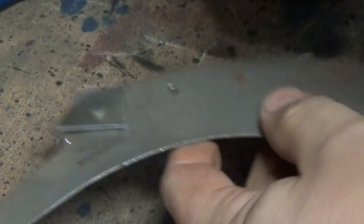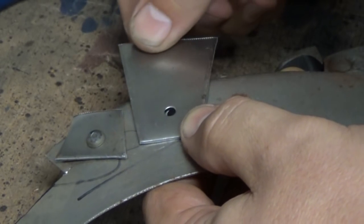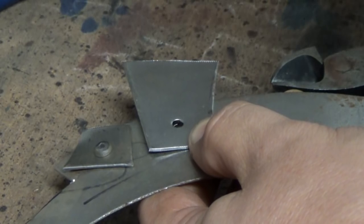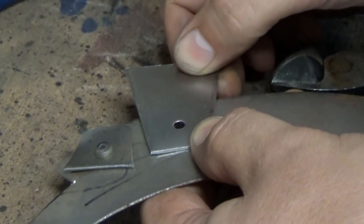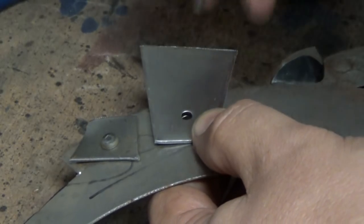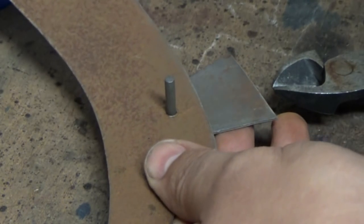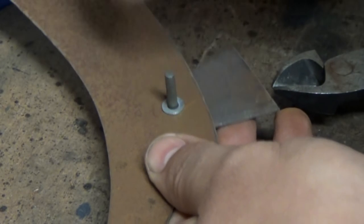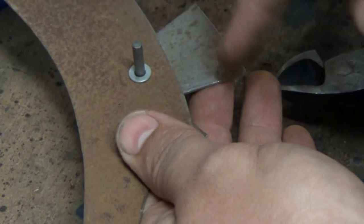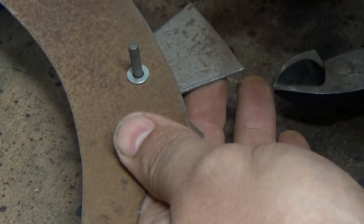Another sort of riveting you'll be doing a lot of as a medieval armourer is a rivet that can travel a bit — slide backwards and forwards, almost like a hinge. You'd see this principally on the sides of things like visors, bevers, a little bit in arms and articulations. It's pretty straightforward — you're just putting the holes in and offering up the rivet. What a lot of modern armourers do, and they did back in the day, is make sure you have a washer. Frequently today, depending on the authenticity you're going for, you will tend to use an engineered washer, but they're quite straightforward to make — you just punch a hole in and cut it out. Just be sure to take these sharp edges off; you wouldn't want that anywhere near your temple if it's a visor.